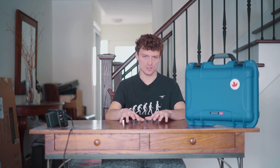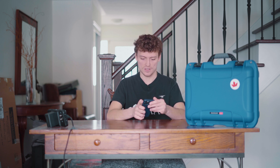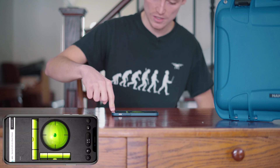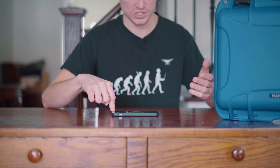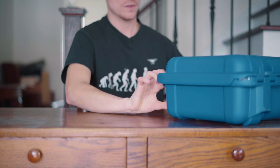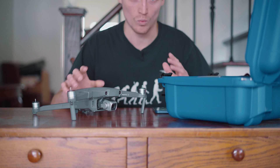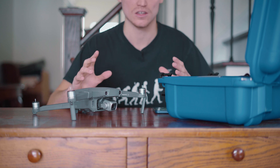It is crucial that you set some time aside and treat the IMU calibration seriously. You need the table to be completely level. I suggest you download an app called Bubble Level — I'm not affiliated in any way, it just works. It uses the X and Y axes. I'm going to put my finger on the cameras on the back of my phone to lift it and make it perfectly parallel to the surface. As you can hear, it's beeping, which means the X and Y axes are completely level. Next, take your drone out, remove the gimbal clamp and the propellers. Also make sure that during calibration — which takes five to ten minutes — you're not walking around the drone or creating wind or shake, because the drone needs to be completely still on a flat surface.